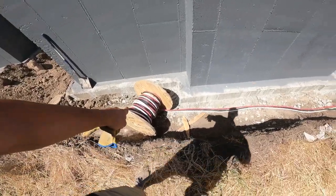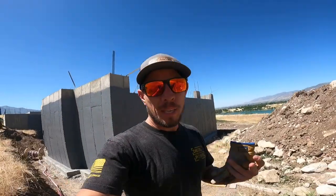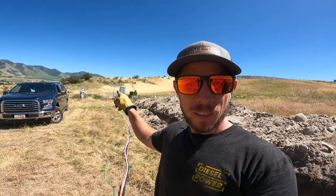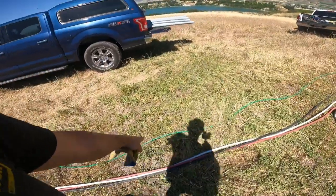This is the wire that is going to power our house — three strands of 350 kcmil wire. That means it's a large enough gauge for this length of run, which is almost 200 feet, to give us 200 amps at the house. Typical house service uses what we call 4/0, but over long distances you get voltage drop — meaning by the time 200 amps travels from the meter to the house, it wouldn't be anywhere near that. So from the start you boost up to as heavy a wire as you can. All three strands plus our ground are here and now we're going to start sleeving it.